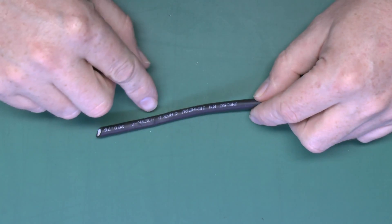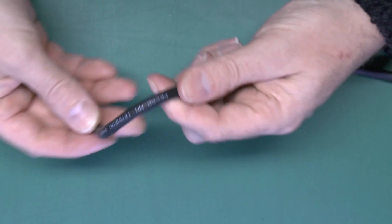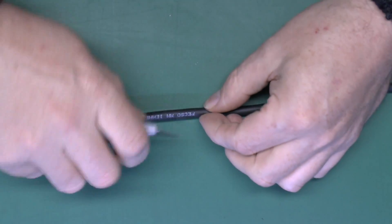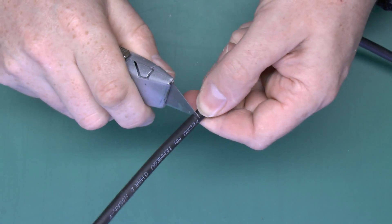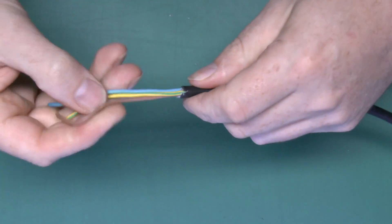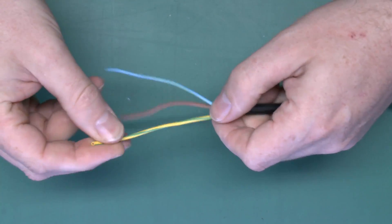Let's start with the cable. What we've got here is some three-core cable — three cores at 0.75 square millimeters. We need three core because this fitting is metal and we need to make the connection to the earth on the side. Normal plastic ones only have two core. This particular black flex annoyingly has white printing on it, so we're going to start the fitting here so the white printing won't show when it hangs up in the ceiling. Just score along and cut around here — this is actually rubber flex with a matte finish, which is somewhat tidier. Just break that off and make sure you've got the three cores undamaged inside. We've got blue for neutral, brown for the line, and green and yellow for the earth connection.